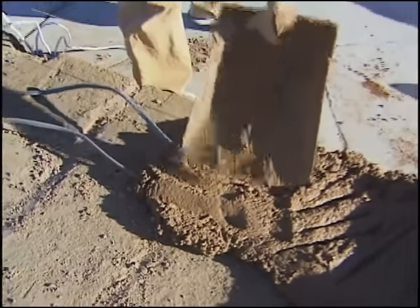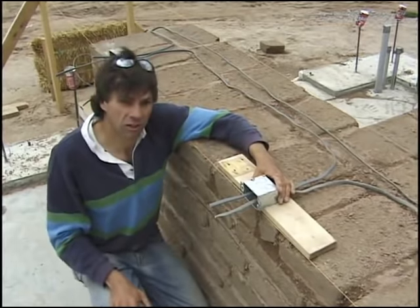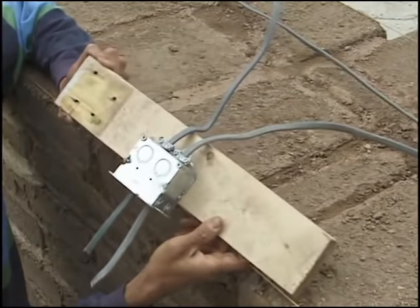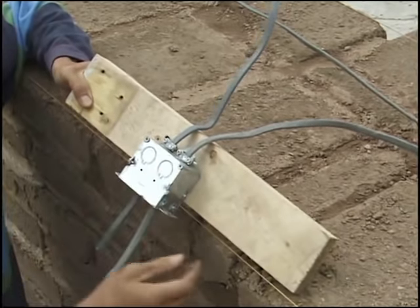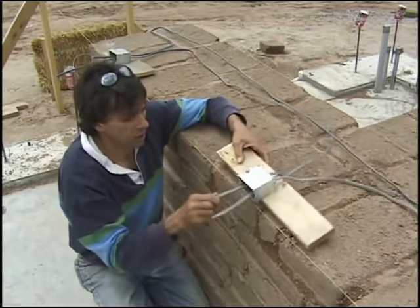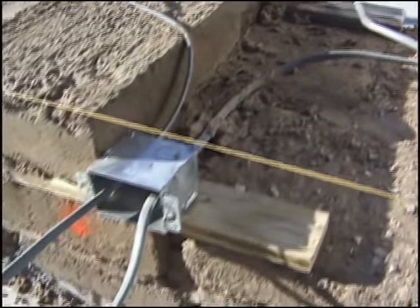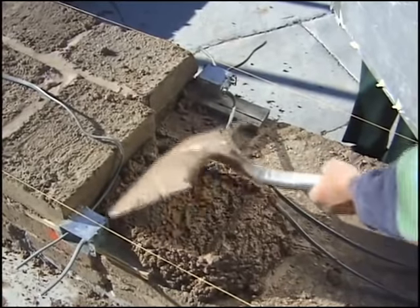These cables lay out on the course in which you want your plugs to occur, and then they come out into the outlet. One difference with the outlet in an adobe wall is there isn't a wooden stud to nail it into. So what I've done here is taken a three-quarter inch by three to four inch width of scrap wood and screwed the electrical box directly into the piece of wood. We've used what are called strain reliefs on the back so the wire will not pull out. We just leave it in this state until the electrician comes in and wires it up later. This then gets adobes laid up on top of it with mud mortar, which forms a sandwich and really locks this into place so it can't move.